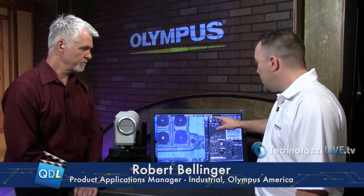One starting point is the Best Image function. Going into the screen, the Best Image function was always capable of showing different imaging techniques in the system. Users could walk up, hit a button, and it would show several different images of their sample at different lighting effects and imaging types — bright field, dark field, DIC, or their unique mix function combining bright field and dark field — and then select which one they prefer.